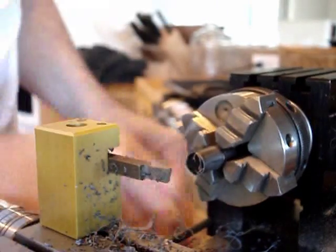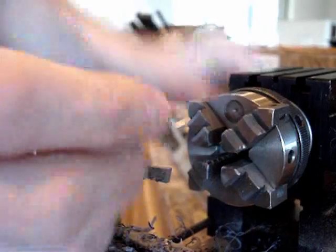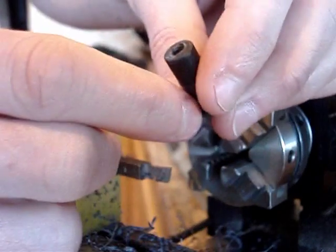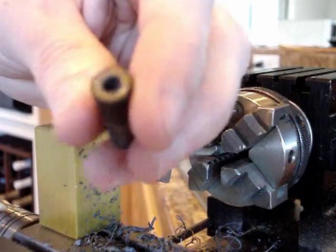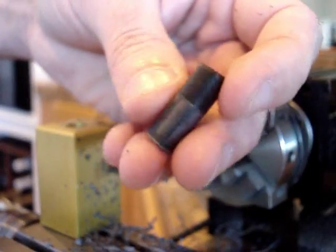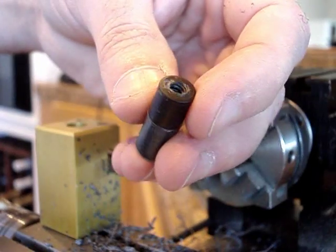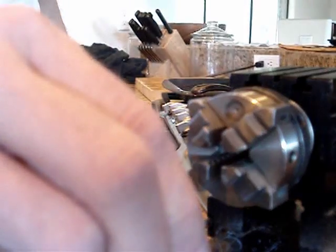I don't have much to do these days — I'm basically retired, or I should say between projects. Now you can see it's starting to look pretty good. What I'm going to have to do is turn the diameter of this down, then drill a hole — I have to get my mic out and check the sizes. But as far as manufacturing a part, you can see in five or ten minutes I was able to take what would otherwise be a discarded part and turn it into the beginnings of a threaded insert to salvage the headlight assembly on my Yamaha R1.